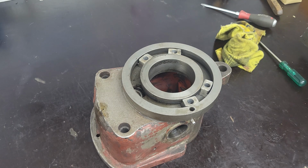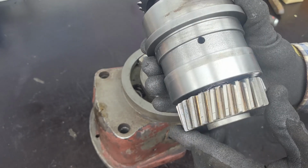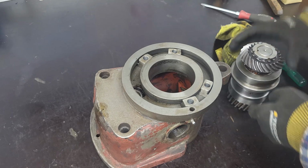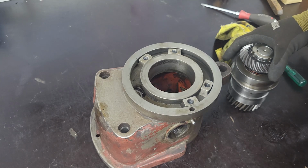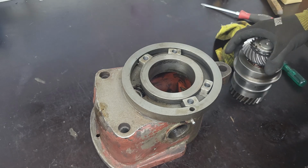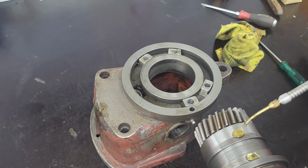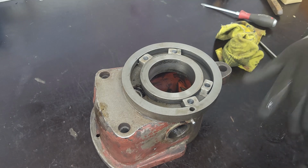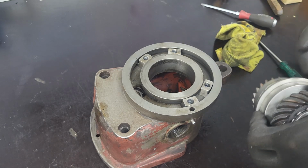And on this one we have the greasing channel. So here you can see that one. And here are the bearings that we pressed in. I don't know if that's visible, but this housing should be filled with oil or grease. Let's check that. Here we have the greasing nipple. I think that one looks more like grease than oil. Yeah, I think so too. We should put a little bit of oil on that one. Just a thin layer of it, and I think that will help it.